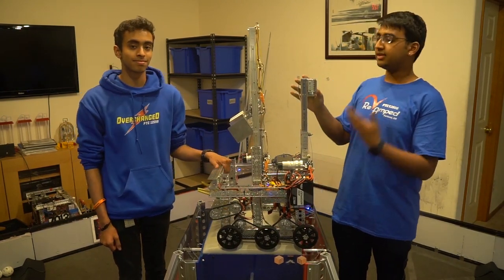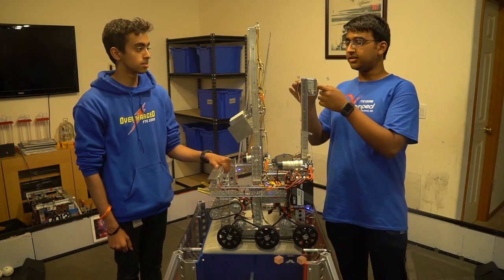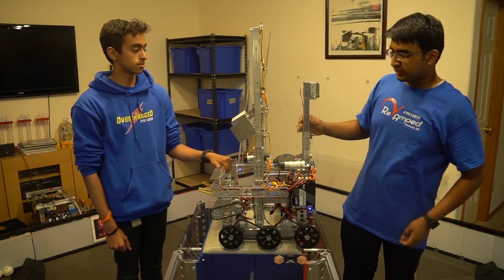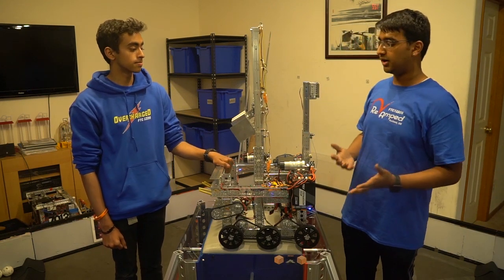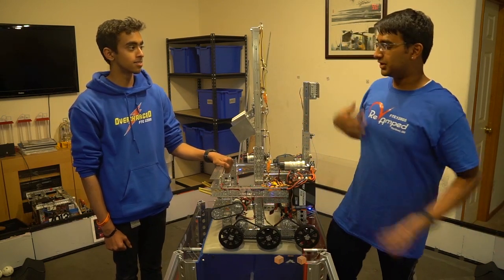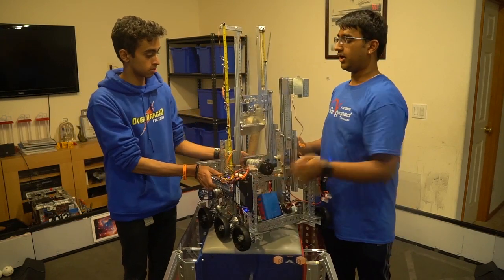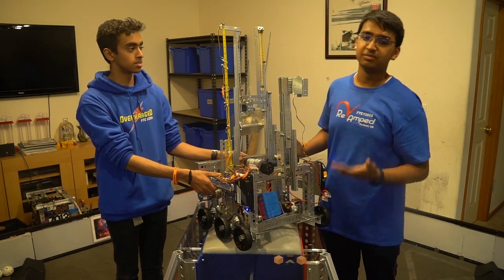The mechanism on top of this slide is the same one we showed you in an earlier event update. It functions by having a spring-loaded servo which puts all the weight on the spring and the mechanism instead of on the servo. One of the main ways we were very successful and quick was through scoring our particles. We created this linear lift, and it's powered in both the up and down directions, with two simultaneous pulleys allowing us to go up and down as quickly as possible to maximize our cycle times.